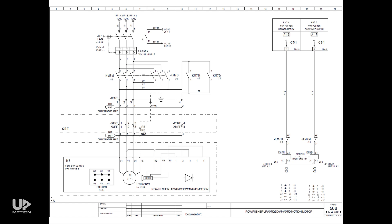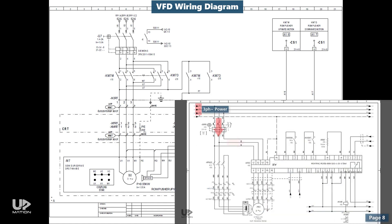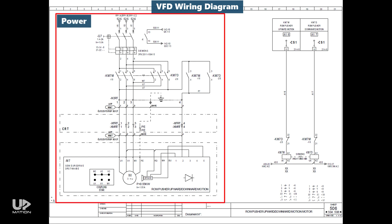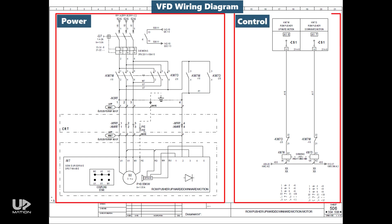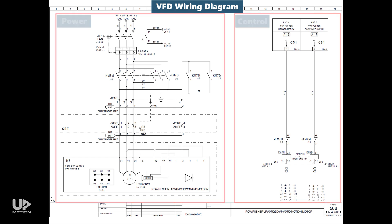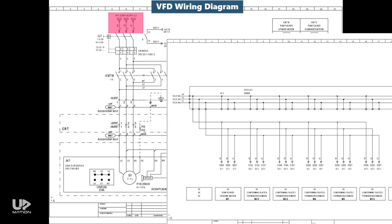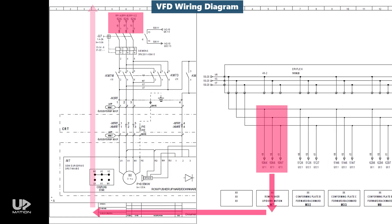The next section I'm going to briefly review is the VFD's cabling and wiring diagram. The corresponding page from this document has pretty similar information to the previous video, but with a different layout. This is the power section and this is the control section, or the signals from PLC. The input power is coming from one of the power distribution terminals at the very beginning of the drawing.